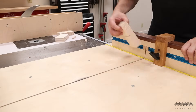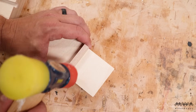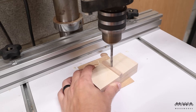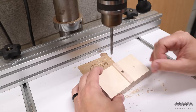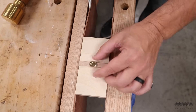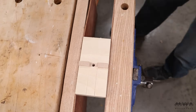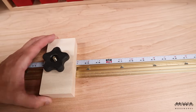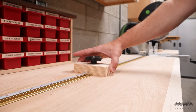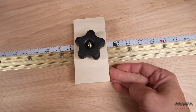Next, I cut a notch in the middle to hold a hardwood runner that'll slide in the t-track. To install the runners, I just add some glue and tap them into place, and a clamp holds everything while they dry. The next step is to drill a quarter-inch hole in the center of the runner. That hole will be used to hold a t-bolt, but first I need to mark the edges of that bolt. I then cut up to my lines using a handsaw and pop that out cleanly with a chisel — now I have a nice recess for the t-bolt. The t-bolt slides in the t-track, and when this thing clamps down, it's not going anywhere. And that runner riding in the t-tracks means it will never wander off square. It's rock solid. Eventually I'm going to go back and make a flip-stop version, but I'll save that for later.